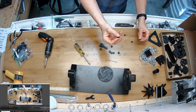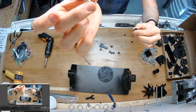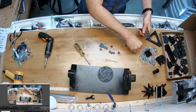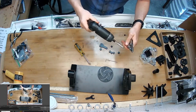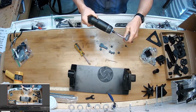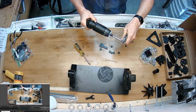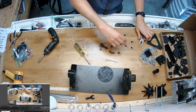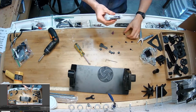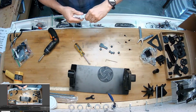did these guys. I grabbed the 4 grip 3D printed parts, and I took 4 18mm long screws, and I just threaded them through. And then I actually put a little dab of super glue on the end just to make sure that the screw cannot rotate within it once it hits the end. Just want to keep it there permanently. Here we go. Since we already are using super glue. Oops, which one was that? That was this one. No, it was this one. There, so I did that to all 4 of those.